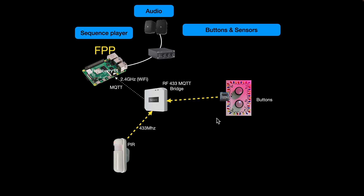In the end, the solution I went with uses old-fashioned technology - like garage door openers - 433 megahertz. It's a low frequency but has really good range; you can typically get over 200 feet if you set the voltages right, even with walls in the way. Because 433 MHz is much lower than typical Wi-Fi at 2.4 gigahertz, low frequencies pass through brick walls, which is very useful in the UK. I keep my Raspberry Pi in the house connected to an internal projector, so signals must pass through several brick walls. This is a completely wireless solution.